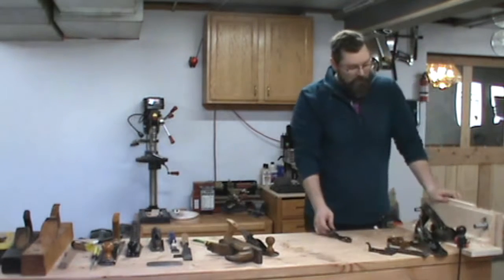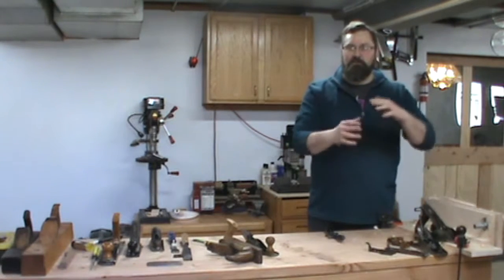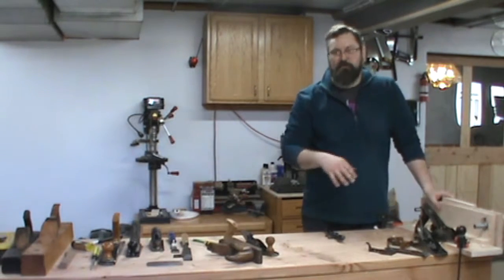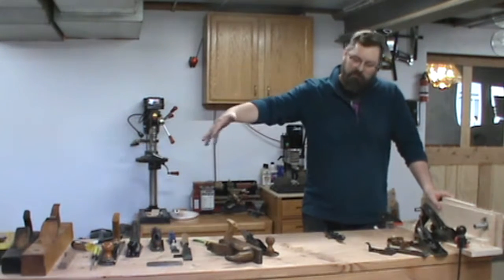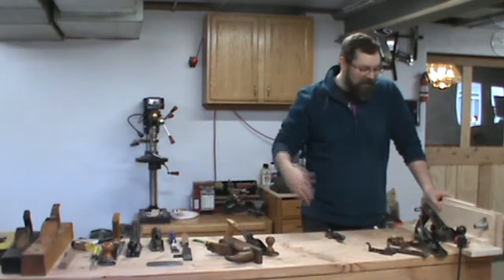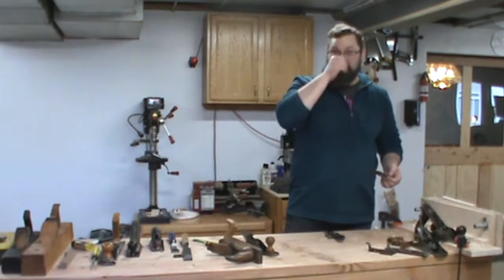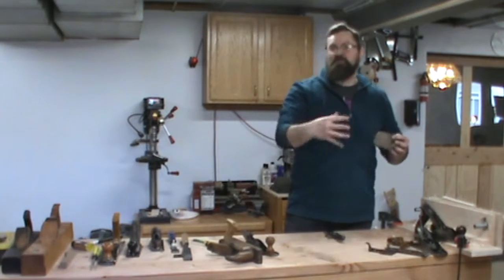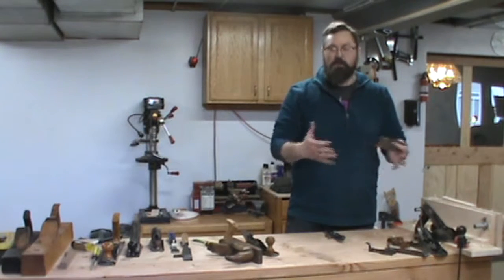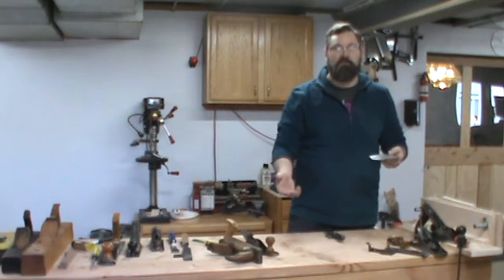For a board that has a lot of tear out that you can't avoid — like curly maple, figured cherry, any time you get different directions of grain — it's kind of like having a velour couch where you run your hand across and it's dark, then you drag your fingers back and get these light streaks. That type of material has what's called chatoyance — the way that the light reflects off the fibers of the couch or off the grain of the wood. If it changes that quickly, sharpness fixes just about everything. So if you're having trouble, sharpen the tools and it will clean a lot of that up.